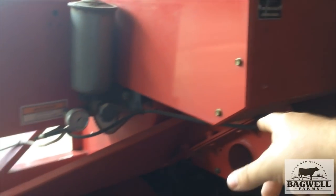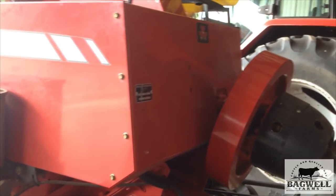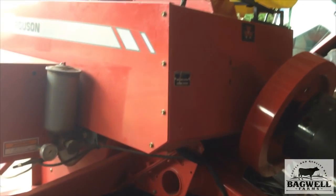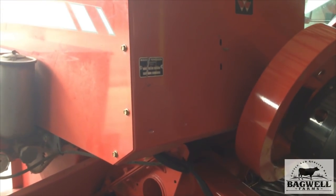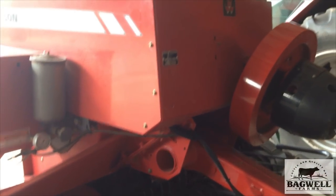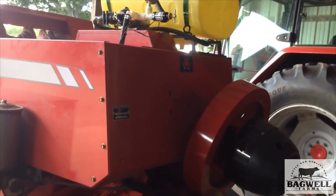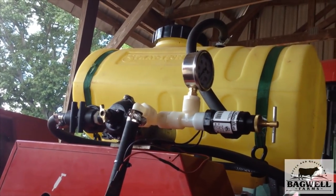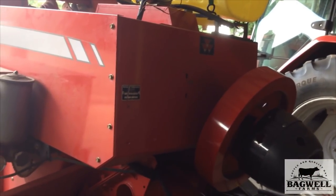The commercial systems also come with three nozzles mounted on a bar. As the hay goes through and the moisture sensor on the baler senses moisture level, it will automatically change nozzles — spraying more or less, going from the first to the second to the third nozzle depending on how wet the hay is. It does it all automatically. But those systems run probably $2,000 or more. This system straight from Harvest Tech — the on/off switch version with everything you see — is around $1,400, and it comes with an electric regulator.